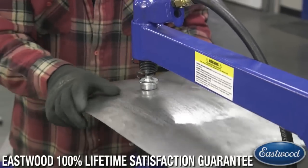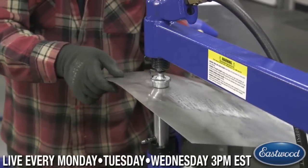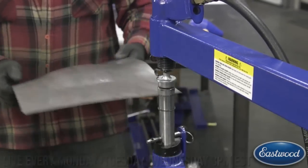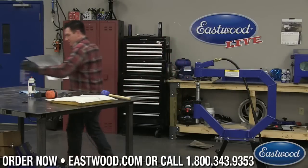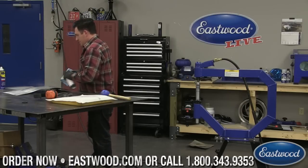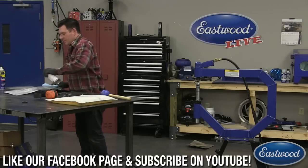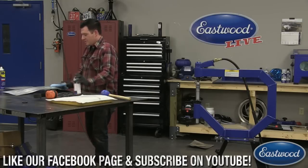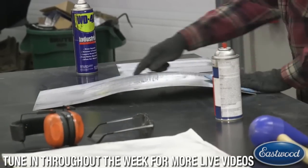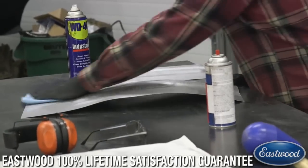So when you're doing a panel that has some curve to it, make sure you're working the panel so that it best fits. So over in these areas, I'm turning to the side like that. So let me spray this off with some pre. And we'll show you guys the finish. And I mean, I just worked this real quick. You could spend a lot more time if you want to really work it. So there's still a couple stray hits that we did out here where you could turn the hammer down and planish those out, or you could just hit it with a hammer and dolly really quick.